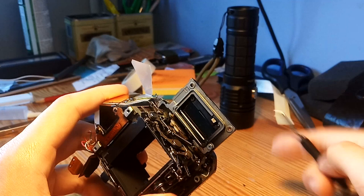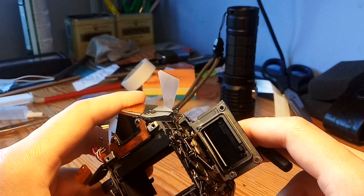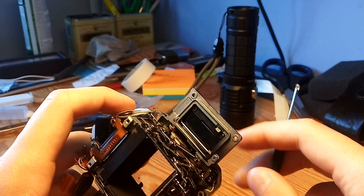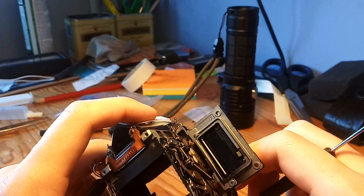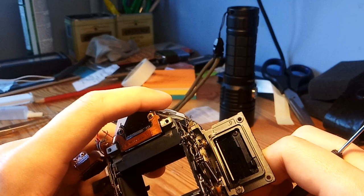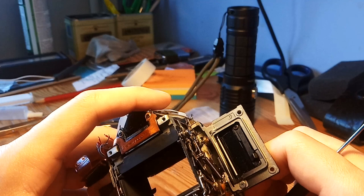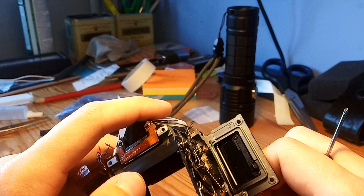How the brake works is it converts that movement into a rotary movement of the sprockets, and eventually converts the movement into heat. That heat is distributed into air via the lubricant or bearings, and this is how the mirror stops. As you can hear, the governor is pretty much dry — never been opened in 40 years — and it causes that horrific sound which is the infamous shutter squeal. It's actually the mirror damper being dry, screaming for some lubricant.